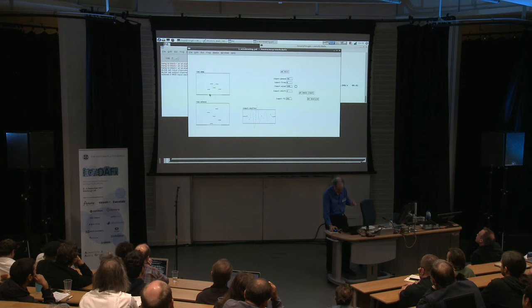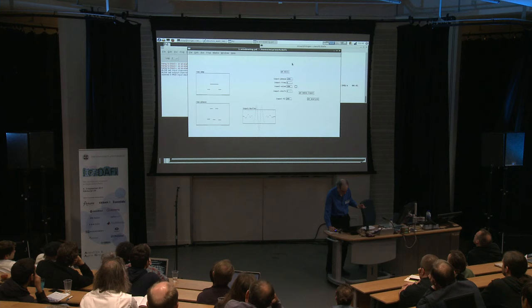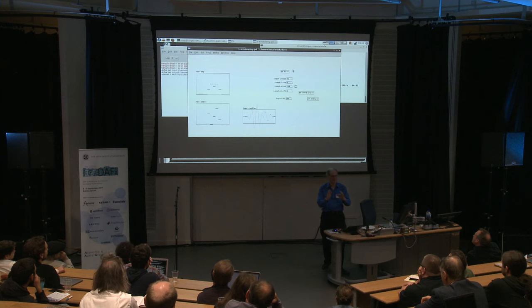And now, the funny thing is, I don't know if you think this is funny. I think this is funny until I get upset. What you can now do is, what about changing the phase of the first one? Now, changing the phase of the first one when the second one isn't there doesn't do anything to the amplitude spectrum, right? But when you have this puppy here, then when you change the phase of the first one, you get a different amplitude in the place where the two overlap, right? You all know this is there, right? And you've probably looked at a nice spectrogram and watched two things beat.